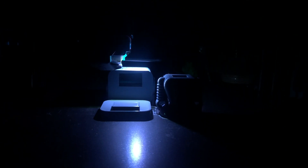The stock settings for this printer are 100 millimeters per second, which I found a little too fast and jerky, so I slowed it down to about 60 millimeters per second and I've been having flawless prints. It also has a really cool LED attached to it, which makes printing at night look extra awesome.